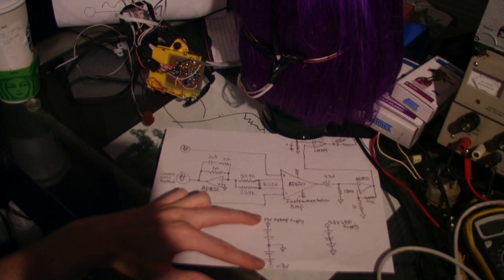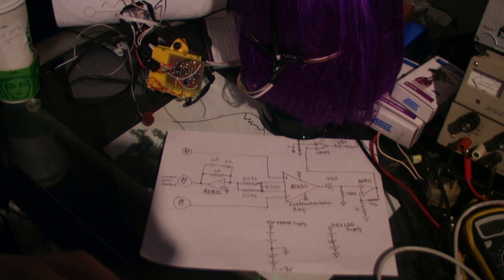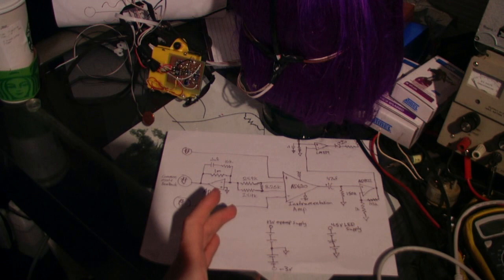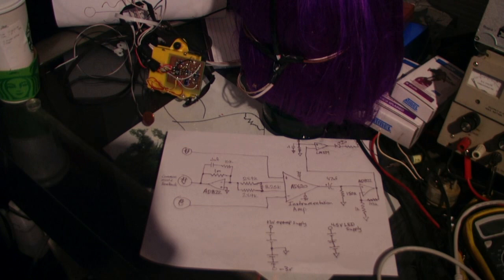My supplies were done with batteries, so I had two different power supplies: about 3 volts negative and positive for all the op-amps, and then a 4.5-volt battery pack for the LEDs alone. If you're going to do these experiments, be very careful that you either use battery packs, or you very carefully watch the isolation of any power supplies connected to your head. You don't want to run 110 volts accidentally through your body because of some ground loop through a switching power supply.